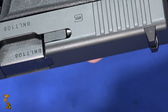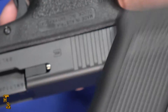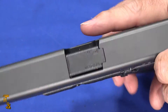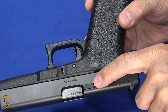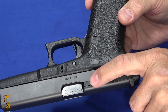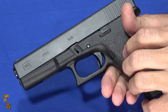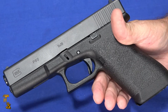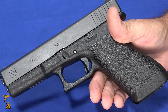One other thing you'll notice externally: the extractor is flat — it doesn't have the little hump to act as a loaded chamber indicator like you have on the Gen 4. When chambered, that hump sticks out so if you run your finger across it you'll feel it. The original Gen 1 didn't have that, so they kept it absent here. However, they did keep some improvements made over the years — for example, on the extractor there's a little cutout for debris collection on the inside. The Gen 1 didn't have that; it was flat internally. This one has the debris collection slot so debris won't hang up the extractor. There are some changes that deviate from the original Gen 1 that were made to improve reliability or safety.